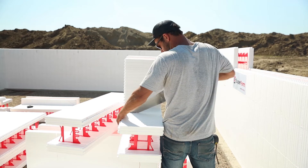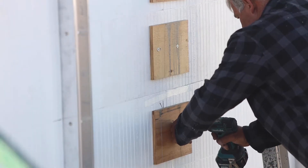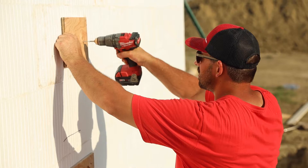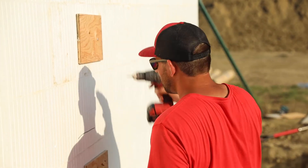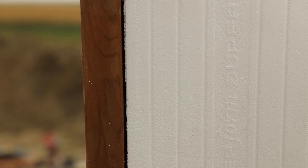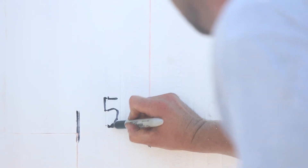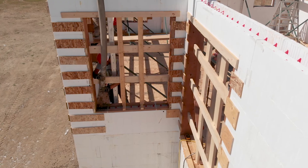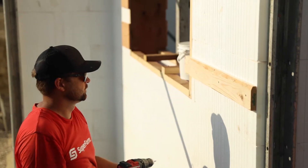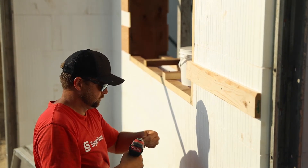This may arise when a block is cut. Wood cleats are usually used for additional support where you see the following criteria: the integrity of the tie or foam has been compromised or broken; when there is 4 inches of foam extending past a tie; beside a window or door when there is 3 inches of foam; ICF block overlap is less than 8 inches; or if an opening is closer than 4 feet to a corner, then add additional support to tie the corner and opening together.